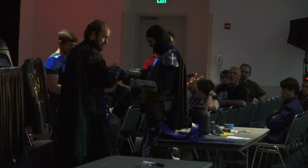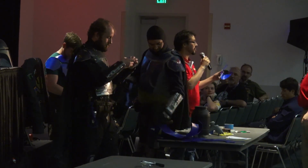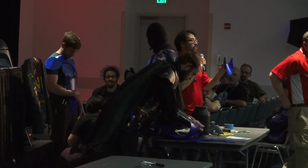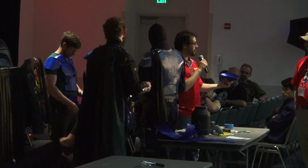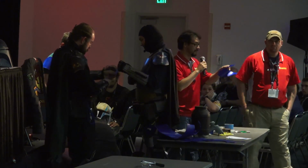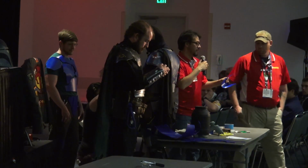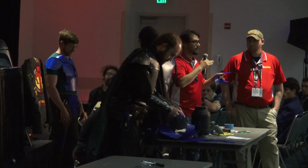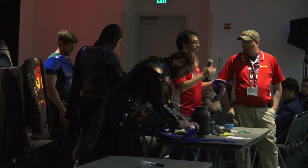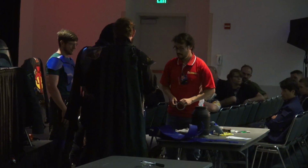Using the Dremel, there's an issue. Foam PVC is a composite plastic made up of color dye and other recycled plastics. It's like the plywood of the plastic realm, so you can get air pockets, and harder or softer pieces in there. When I used the Dremel, it would catch something and bounce or grab, and it would break your Dremel disc, or bounce into the piece you wanted cut, and you had to start all over. I've used the saw, but it does the same thing. That cutting disc wants to grab and bounce around, and it's a hassle. The X-Acto blade takes a little bit longer, but it ends up giving you a better product in the end.